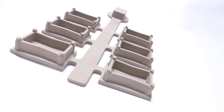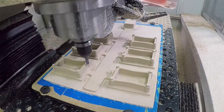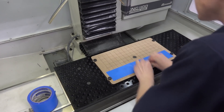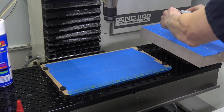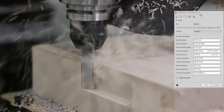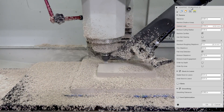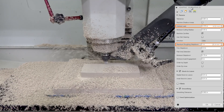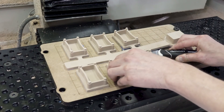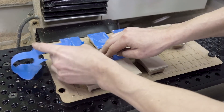In Widget 193, we machined a casting pattern that was later sent off to cast a number of micro surface plates. It's a great example of where super glue works even when your sub-fixture is wood. After applying the painter's tape, we used a dowel pin to burnish and really push the tape down to ensure good adhesion, then super glued our block and laid it down. A real advantage of super glue over vacuum here is that if and when you cut all the way through your part, you don't risk losing your workholding. The concern was how to separate the part at the end without breaking it — a sharp putty knife or paint scraper worked to gently work up the edge and pry underneath. The tape just pulls right off with no super glue residue.